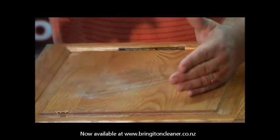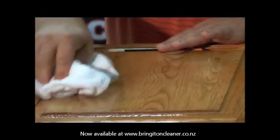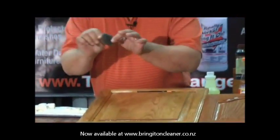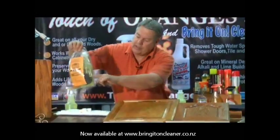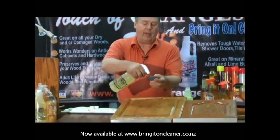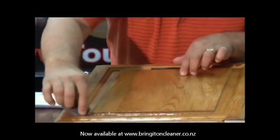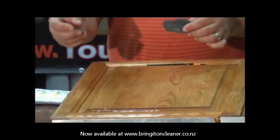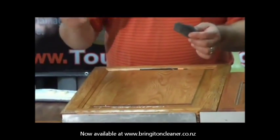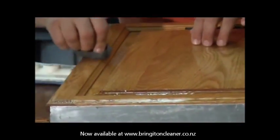So let's clean up this mess. Now for these kind of cabinets, the way they're designed with these little hard-to-get-to areas, in all of our products that we sell, we actually include a real fine piece of steel wool — you can see the applicator right in there. So you want to put some cleaner on the little applicator, and that's how you get to these little nooks and crannies where the buildup likes to hide. The other thing we see with kitchen cabinets is where you open and close them — the grease and grime from your fingers kind of leaves a little — we call them grab marks — a little dark area. This is how you get rid of those grab marks without harming your finish.